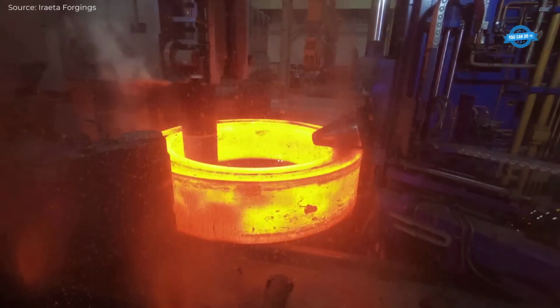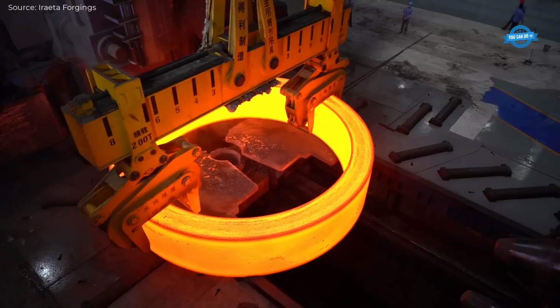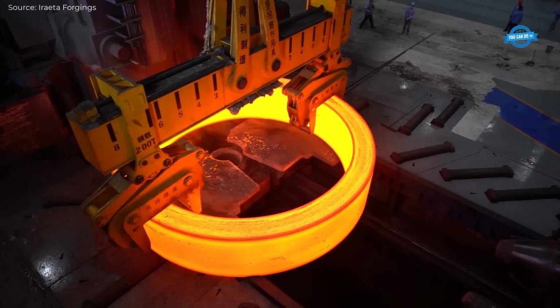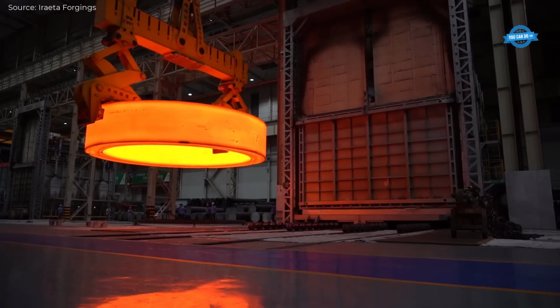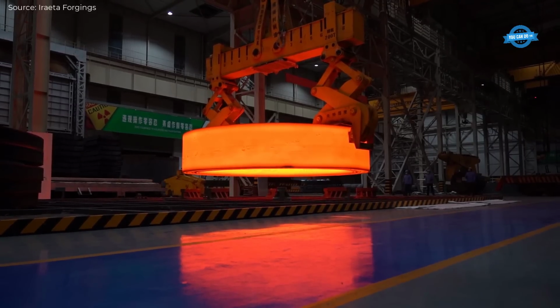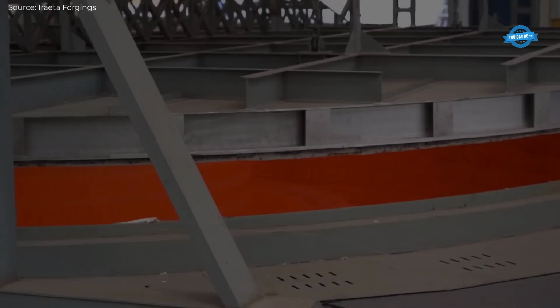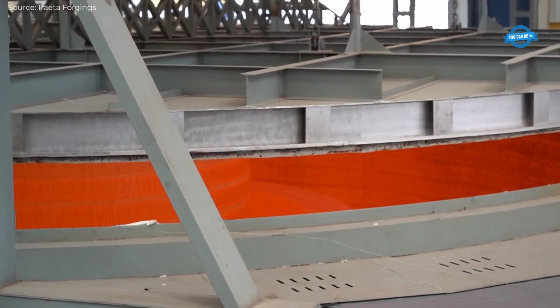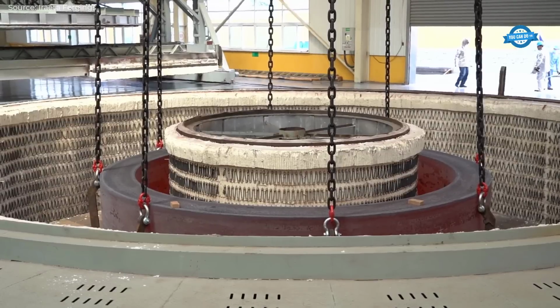The machining capabilities at the facility are equally impressive, with over 20 large and medium-sized sawing machines capable of handling materials ranging from Phi 100 mm to Phi 1500 mm. The round billet grinding machines have specifications of Phi 80 mm to Phi 800 mm, and the maximum processing diameter of the large-sized horizontal lathe is Phi 1200 mm.